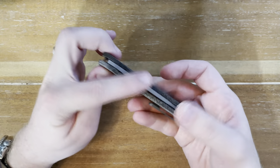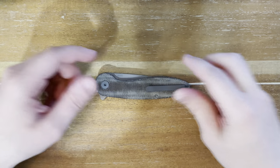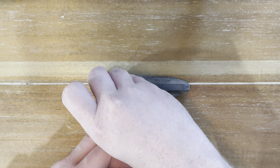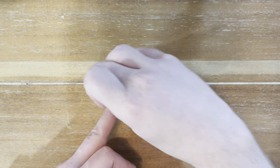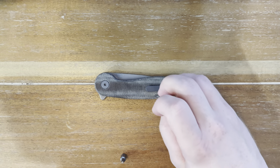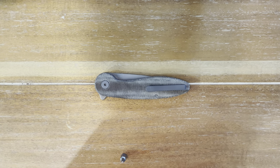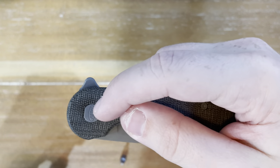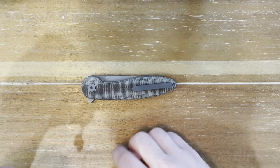So let's get into the knife itself. Looks like we're using a T10 for the pivot, but it's a bit loose — maybe a T12. And definitely a T8 on the body screws. I'm just going to tackle it all from this side. There is actually a shape cut into the micarta that stops it from rotating. Let's start with the pivot first.